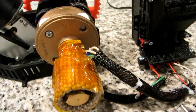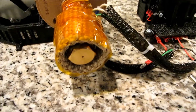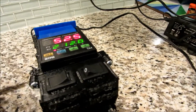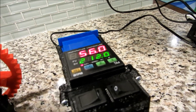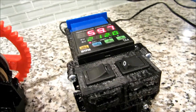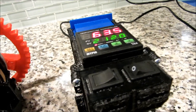This is something you should see — you should start to see the unit heat up. You're going to smell some slight fumes; they're not going to stay after they burn off, and there shouldn't be any fumes from the unit after that. It'll reach temperature pretty quickly, but it's going to overshoot and then settle back down. The best method is to wait about 25 to 30 minutes to really get good thermal equilibrium.